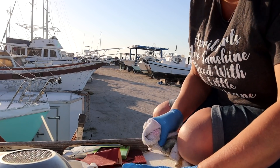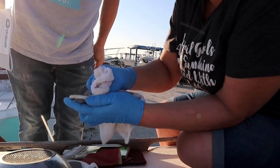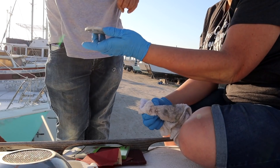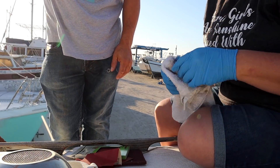How do I tell if this is good enough? I think it just kind of shines the top layer up a little. But they said it could blow up if you do it wrong. It's not going to blow up. The more contaminants are on there, the more it splatters when you weld it. The problem is it takes something like 2000 degrees to burn through the oxidized layer, whereas it might only take 800 degrees to melt the aluminum. So you're getting rid of that top oxidized layer so you don't have to fight through the high-temperature spot to get to the lower one. Does that make sense? Those temperatures are made up, but the difference is real — it's a huge difference.